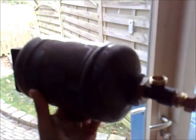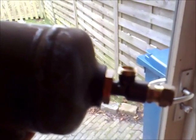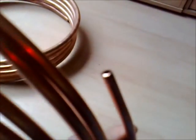The air tank will be mounted like this. The heat exchanger of course goes around horizontally. On the top side I want to make a safety valve. The valve itself should be isolated from the tank for safety reasons — it needs to work also when it's cold. A valve also needs to come on here for releasing the liquid air, and I'm still concerned about the valve working when it's cold. They have pressed some text into the small tubing, which is quite disappointing because a disturbance in airflow will create heat and unwanted losses. I'll smooth the entrance of the heat exchanger and also the tip of the thinner tubing for guidance.